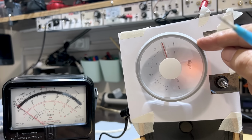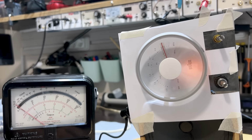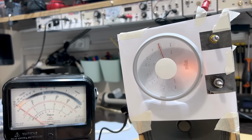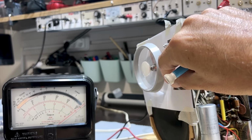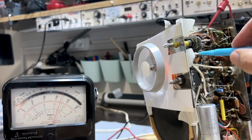So what I'm going to do is put it exactly on 550, and I'm looking at it head on, so I don't have a problem with parallax. Give it some volume, and now I'm going to see if I can get it there. Yeah. There's my 550. Now what I need to do is adjust that coil on the inside for the strongest signal. So now I need the meter. And usually we're basically aligning the front end. I've got my multiplier a little bit too strong here, but put it on 10 volts, okay? And I'm going to align this till I get the strongest peak.